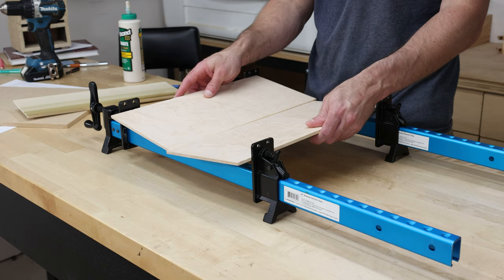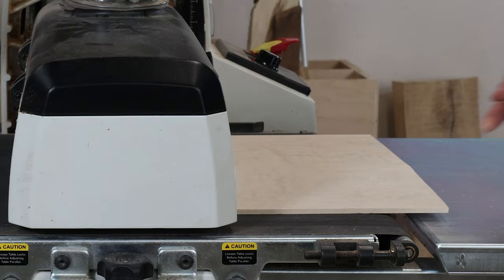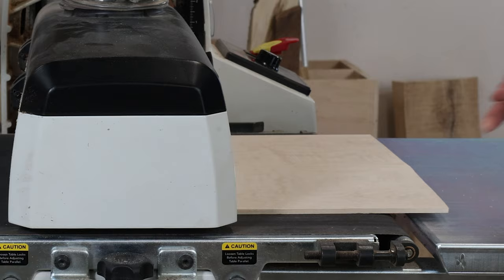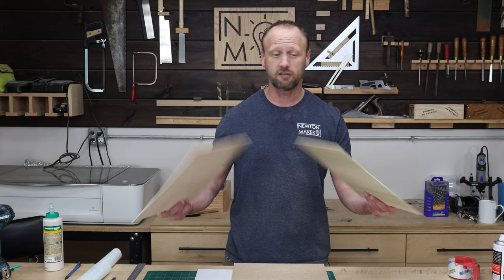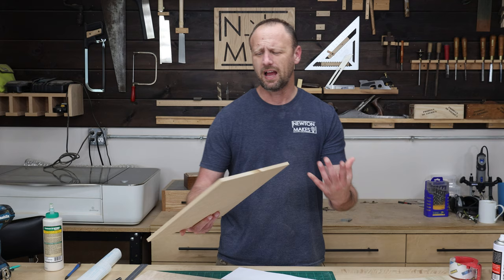If you've only veneered one side of a board but not the other, you risk it bowing and really becoming a big potato chip. After my panels dried, I sanded them down super thin — less than an eighth of an inch thin. I've got both of them here: the poplar one and the maple one. The poplar is going to be for the backside of the artwork, so set that off to the side. The maple is going to be the background and that's going to look really good.